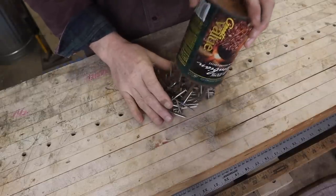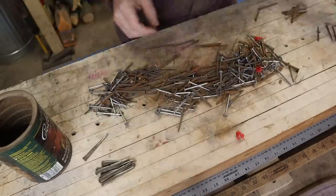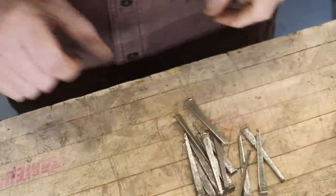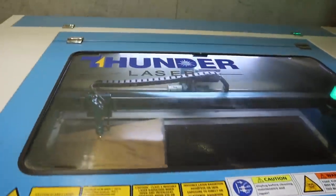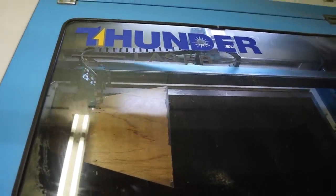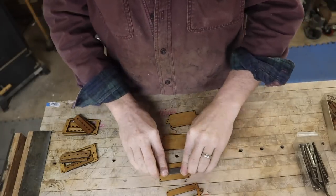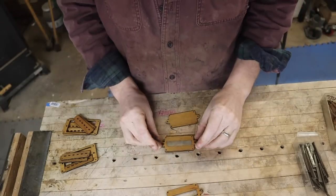I thought that head would look pretty cool as a pole piece, so let's just go ahead and make them. I started by sorting through my grandpa-style coffee can of random nails that I've collected over the decades — I have a lot of cans like this. These nails vary a little in size, so I took some quick measurements and cut out some test bobbins on my Thunder Laser Nova 35 using scrap closet door. That's an alnico 5 bar magnet I'm going to use in the bottom.